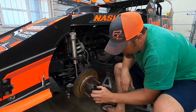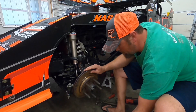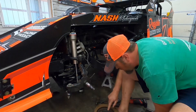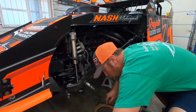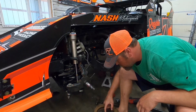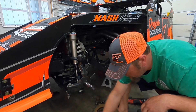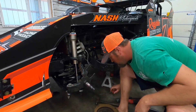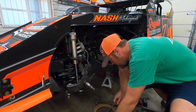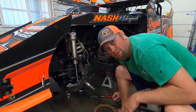Now we got that out of the way. Take the washer, slide this back a little bit, grab your bearing. Now we've got to get the seal out of here and the other bearing. Plenty of grease in there still, so we're keeping up on our maintenance. Hopefully I have a new seal somewhere because I don't think I'm going to be getting this one out looking so good. So let me go find a seal and put it in there because we're not going to be able to reuse that one.